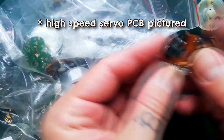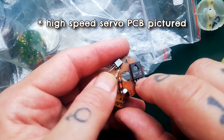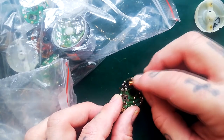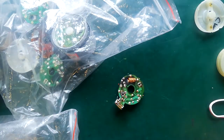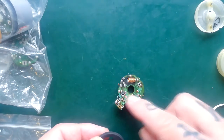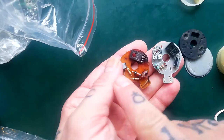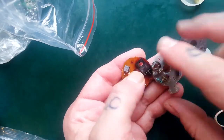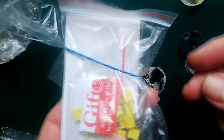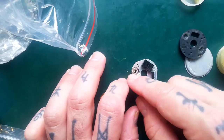I've got a few of these that are really charred - this is the problem. These C1470 motor control chips get really hot. They're dissipating the heat via a little spring to the plate on the back of the motor. You can see there's a cutout in the foam that stops these pins shorting out against the cap and that will be pushed up like that. The original kind with a fresh C1470 chip - you can still buy them as old stock from eBay and so on - that's going to produce three and three quarter inches per second reliably. This one, despite the variable resistor, in my experience isn't.